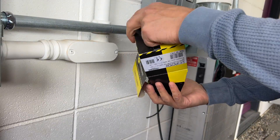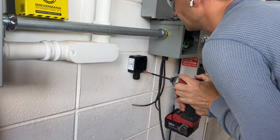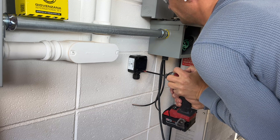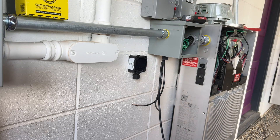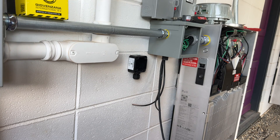This is the emergency stop button which is going to shut down the Powerwalls in case of emergency. We have to run a cable from each Powerwall to this button and land it on its own contacts.